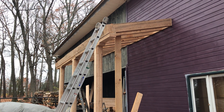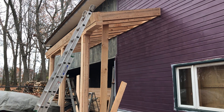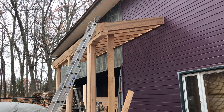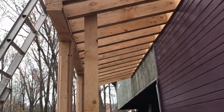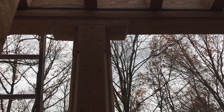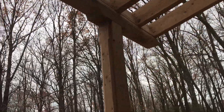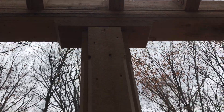We're having a heck of a time here. The second post went in fine, but on the third one, Lucas asks, 'Are we supposed to be in line with the rafter?' I totally forgot — part of this design is that the posts line up with the rafters. My support was about six inches off on every single one of them. You can see right here it's still not lined up, so we're going to pull this one.